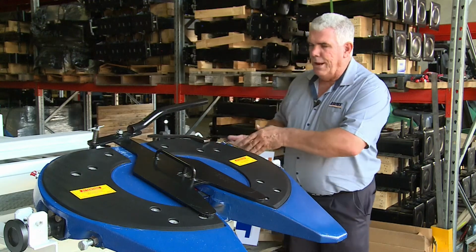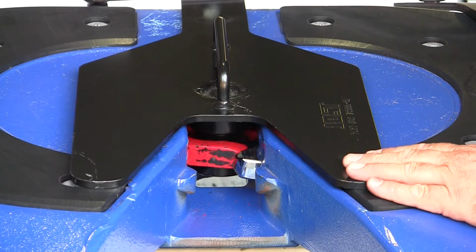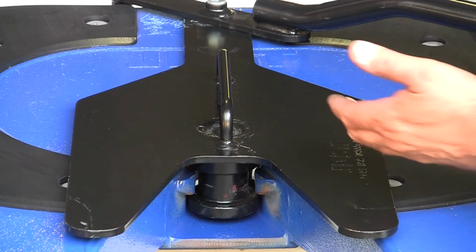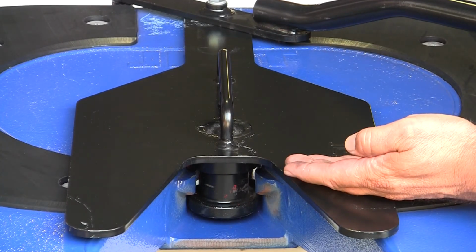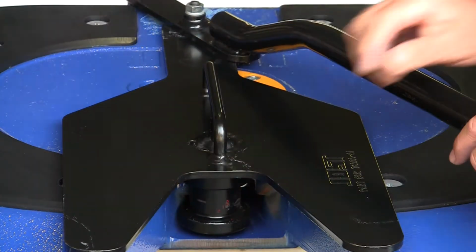When we open the fifth wheel up, we pull the handle out. We can then pull the kingpin tester out of the fifth wheel, and you'll have seen the jaw come open and the lock bar come out, and now you can see the kingpin.